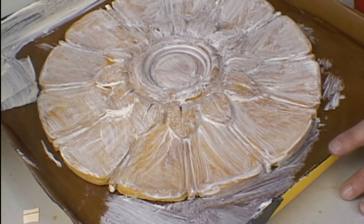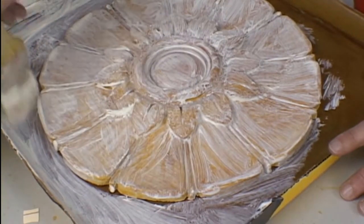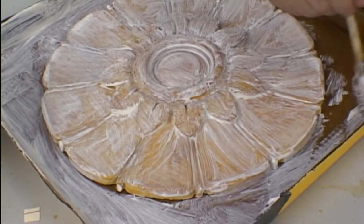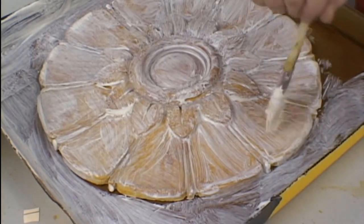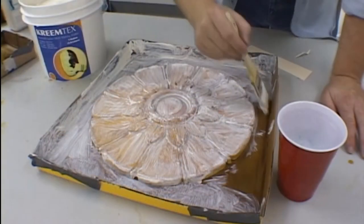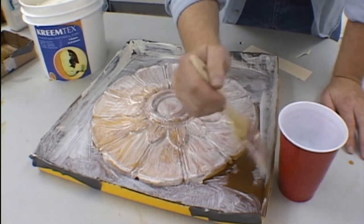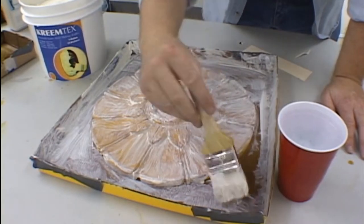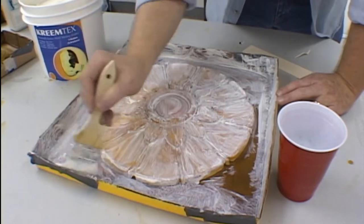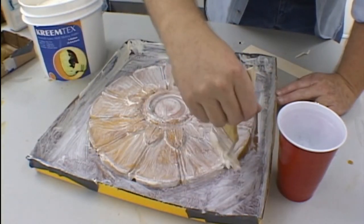Make sure you coat the sidewalls of the mold box, as this will act as a place for the shell to grip onto. You can be more generous with your application of latex to the sidewalls of the model. There is no detail here to capture, so having a little excessive buildup will not hurt you. It may take a little longer to dry than the rest of the rubber, but in the long run, you want a good thickness on the sidewalls of the box.